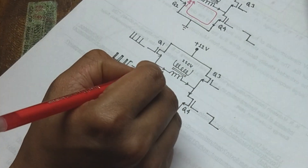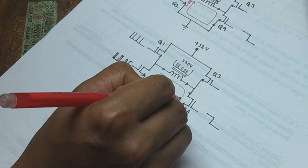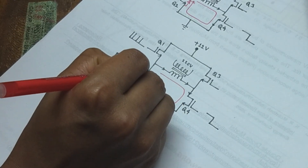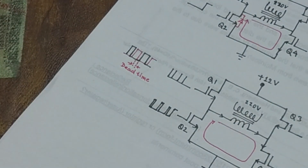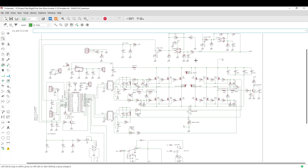To avoid the dangerous situation of turning on Q1 and Q2 at the same time, or Q3 and Q4 at the same time, a dead time has been introduced between them. The second modification is done on the charging and load current sensing mechanism.